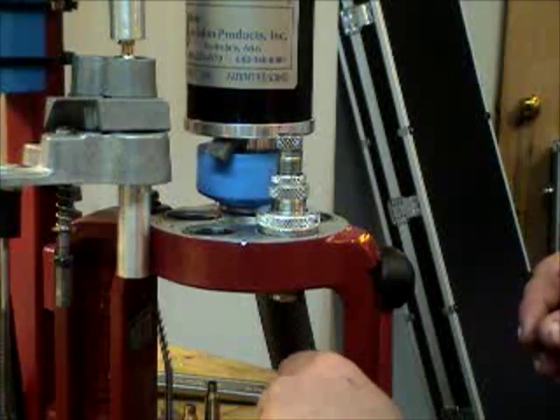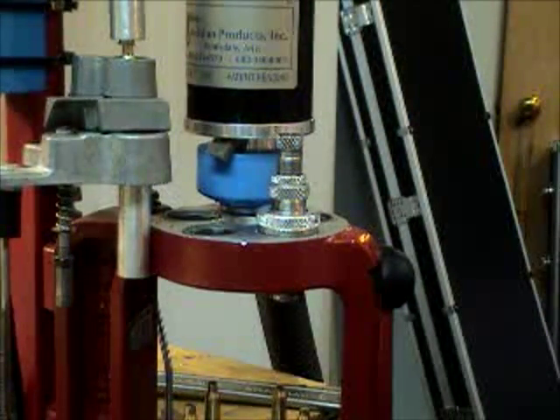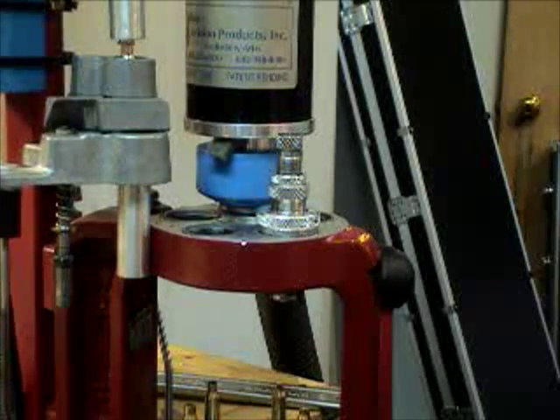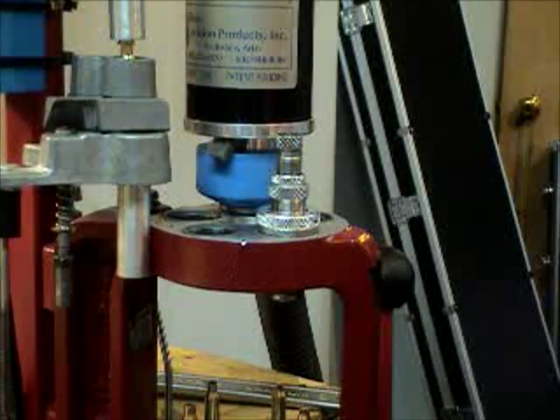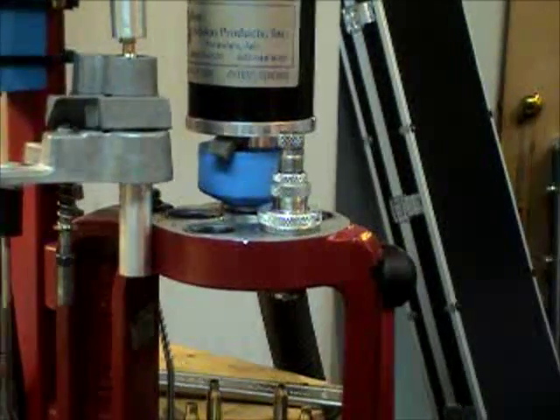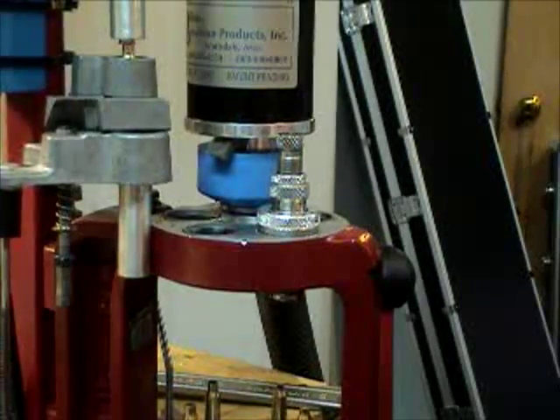So we're going to show you how quick and easy this whole operation works. I do have the CH-4D custom trim die being made for this caliber and my 7.62x40, just so I don't have to use my modified dies, and so I can use this to trim them after I've fired them. This basically is just for getting the cases ready to go. I have to trim by hand after each firing, because the 223 die hole will be too small to work for the 6.5 millimeter projectiles.